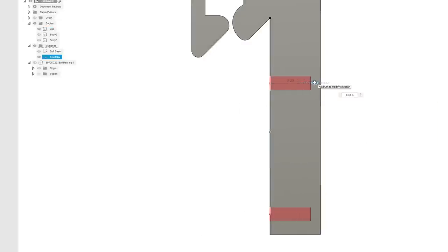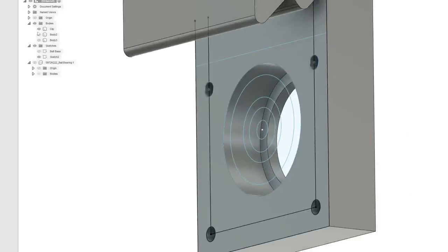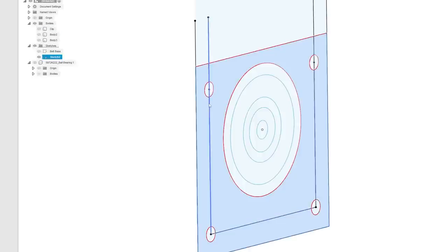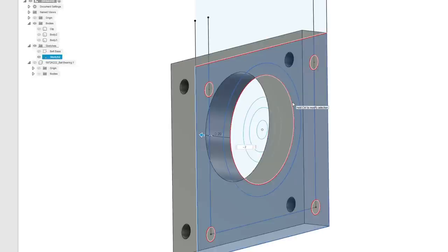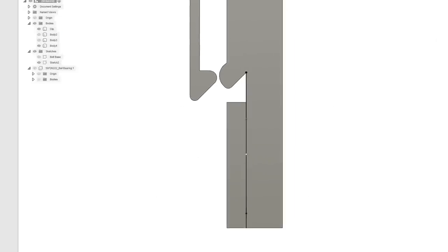We pretty much go all the way through because we also have to think what size screws do we have. Let's turn off this body because otherwise when we extrude, it'll connect to the other body. So let's go negative 0.2. That way we can use a half inch long screw. That should work. So see, we'll still have room to put the belt through.